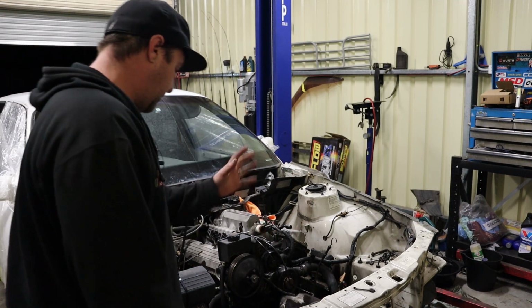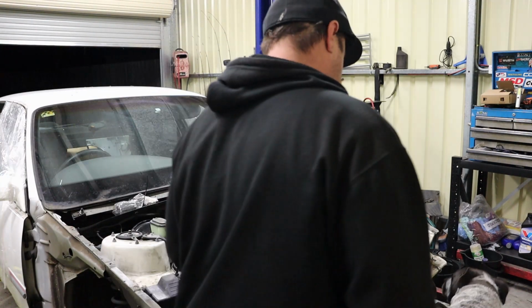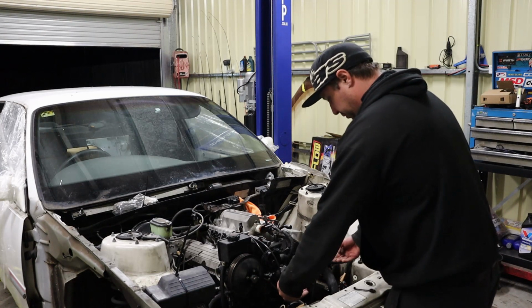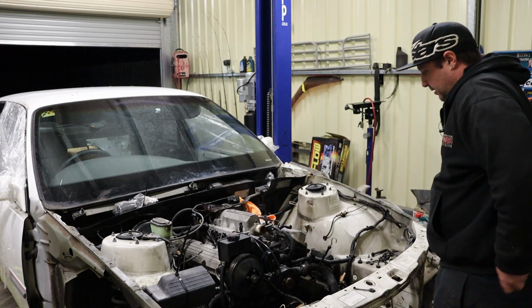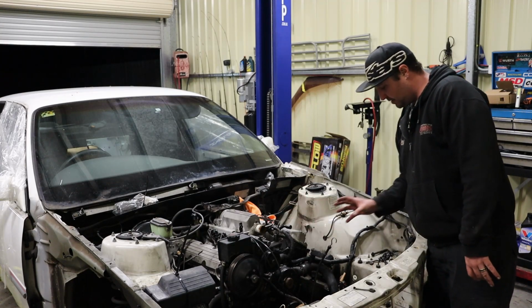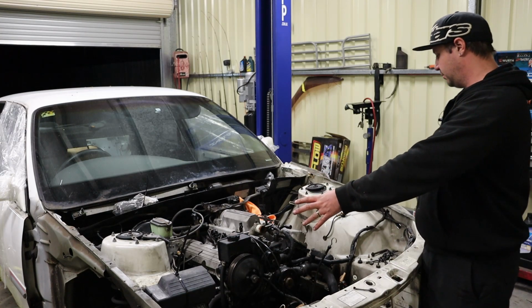We're going to run one here pointing in that direction. And we're going to run another here, so they're going to point towards each other and the exhausts are going out, and he's going to be having the front end tubbed. So my job is to get the exhaust gases from there to the turbo in the form of two manifolds.